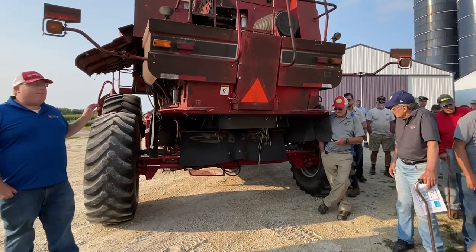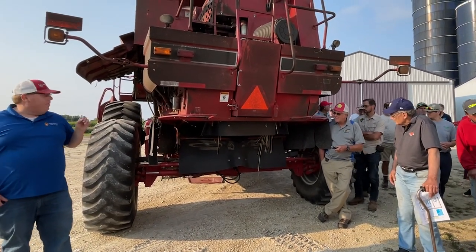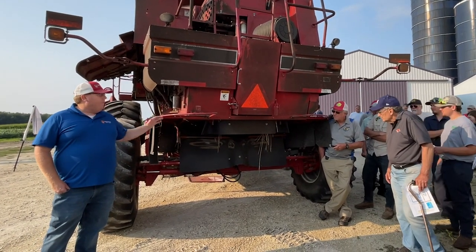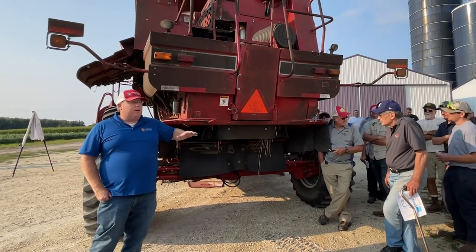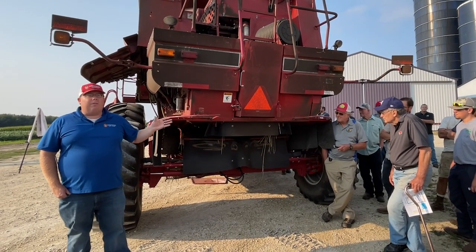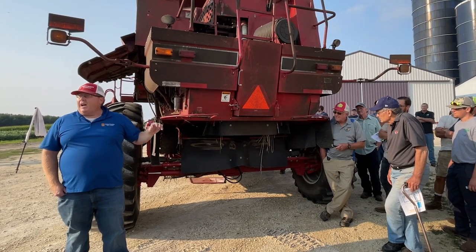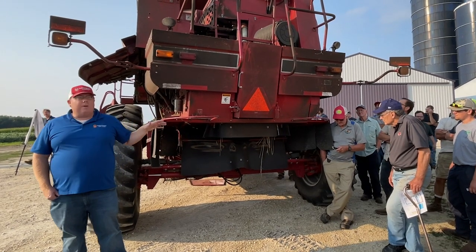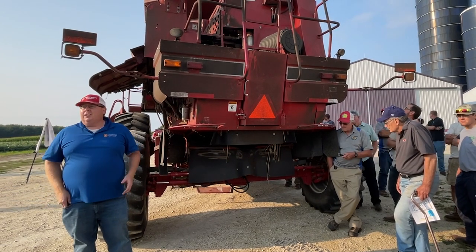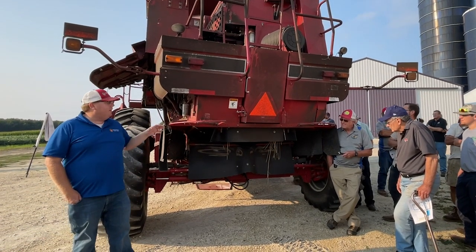However, wheat provides a great visual illustration of where we may see weeds hang up on the axles, the back of the combine. Some of the combines have a more aggressive residue management system on the back. We're just going to blow off the top of that. We've found weed seeds hanging out on the top of that, but once they're on the top of that residue management system, they're probably going to ride down the road and stay there all season. They're probably not going to come back off of that. It's going to be stuck to the biomass.